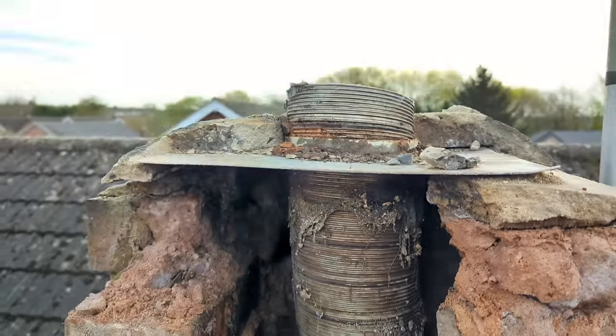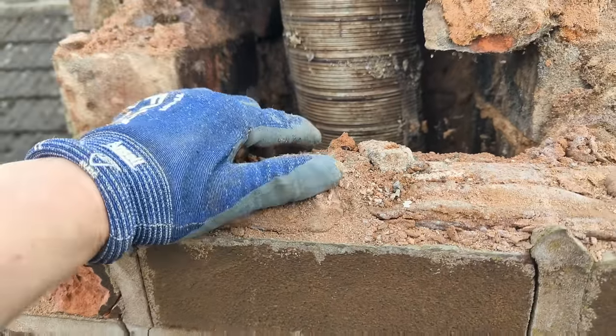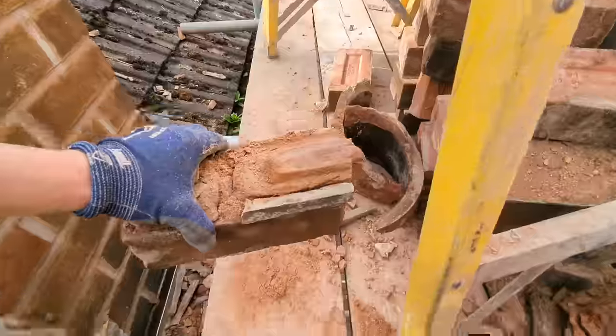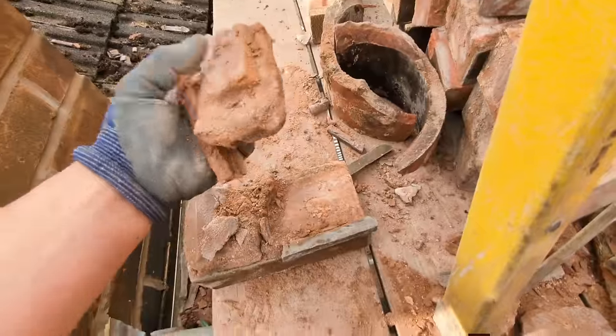This is how we're looking at the moment. Just taking the cap off to stop birds from coming in. You can see how all the mortar has totally turned to dust. Here's a brick I've just pulled off from the chimney — the last courses I'm taking down. This is a good example of the damage the freeze-thaw cycle does to your mortar, especially on a chimney stack.